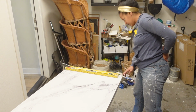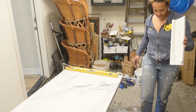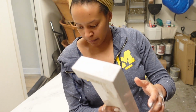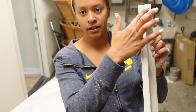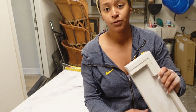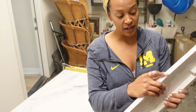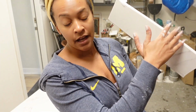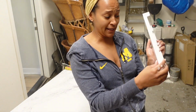Okay. Clean off. My theory was correct. The quartz dropped off. So basically what happened is it had a bull-nosed edge on the side, and it's bull-nosed on the front, which is great, but I didn't need the side piece. And you see how it's thicker here and thinner here? I just needed to cut a little bit off, so hopefully it'll fit into the laundry area, and I think it'll be just fine, honestly. This saw works great. I mean, it's a pretty straight, clean cut. This is quartz. I would imagine it would work really well for marble or granite or anything else.